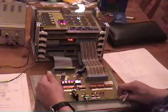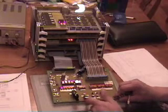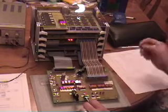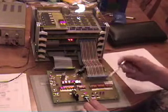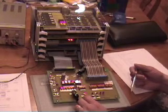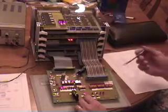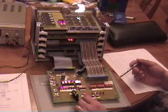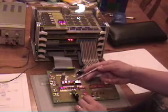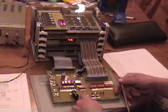So let's go ahead and try it for real. We go from stop to run, and now with the single step clock I'm going to click it a few times to get it going. And this time we should go high — and the clock does. So this is the fetch phase. We're going to fetch the instruction about now. Okay, 7C — which is good, that's the opcode for load 16 — and we've incremented the memory address register to 1, which is also very good. Now we're going to go down to the next micro instruction at 67, which should load the high-order byte of hex 7000 into the memory data register.